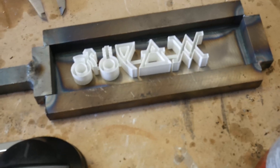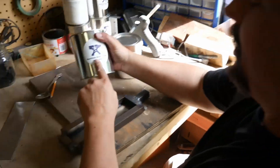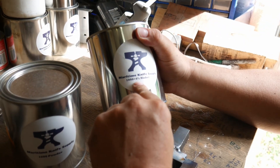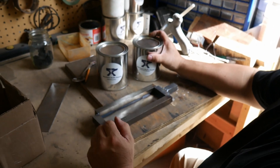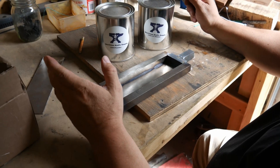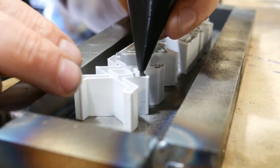What we're gonna do is a little different. We're gonna take the same concept and forge the blade almost in its final form with our pattern in it. This comes with a little bit of science. We're using 1090 powder with 4% nickel powder mixed into it. The nickel will resist corrosion and resist etching. So when we etch our pattern later, anything that is not the nickel steel will go darker, and anything with the nickel in it will resist and stay shiny.